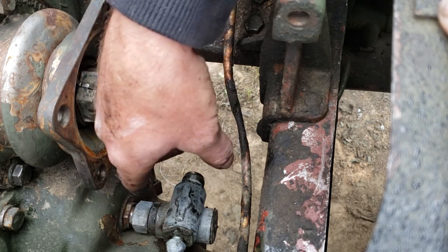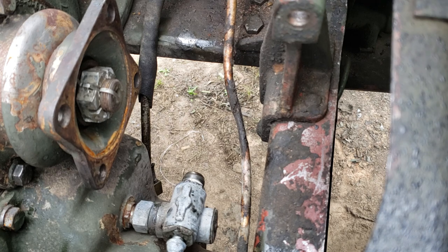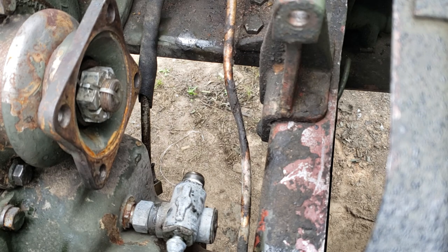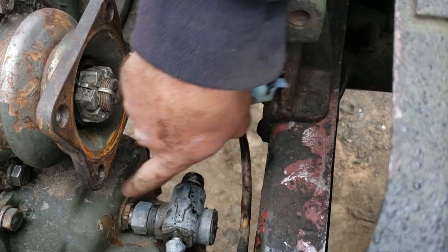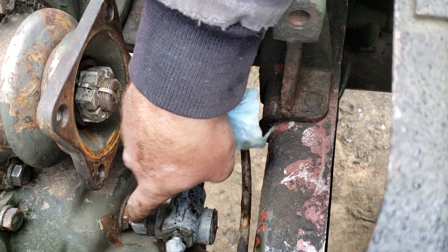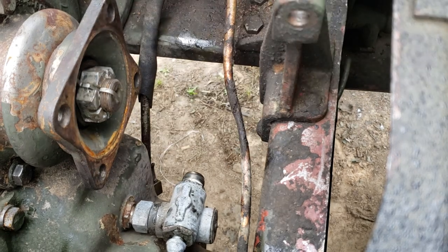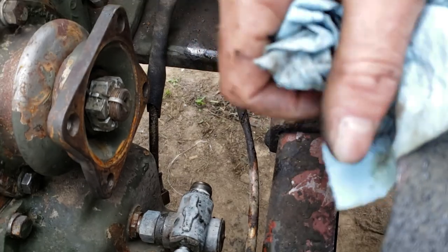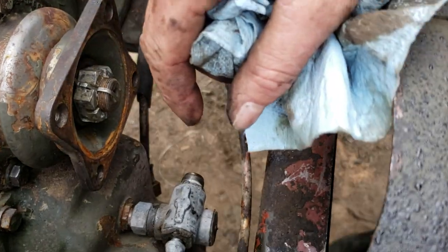It is called a sleeve. They don't refer to it as a bushing in the parts TM. You would think you could get just the little rubber packing alone, but that's not the case because it's a wear item. That bushing, that sleeve, is actually an aircraft part meant to hook up tachometer cables to engines on small aircraft. And it's a wear item, the whole thing.